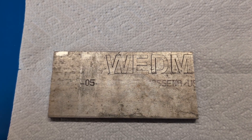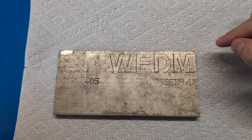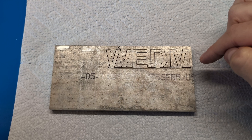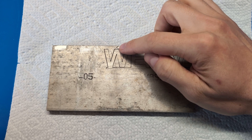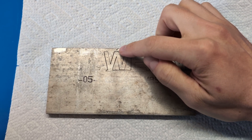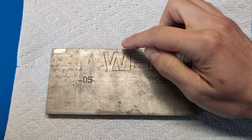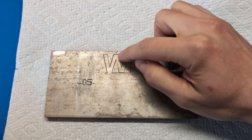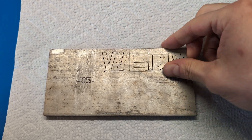We got the part out and dried off — let's take a look at it. Obviously it doesn't come off the cutter like this; I've just kind of reassembled it for fun. I'll show you that all the pieces still match nicely. I paused the print here and then went to bed, and then the next morning when I started it I forgot to start the flushing when I started the cut again, so I broke a wire. My fix was to come in from the side and resume the G-code at this corner.